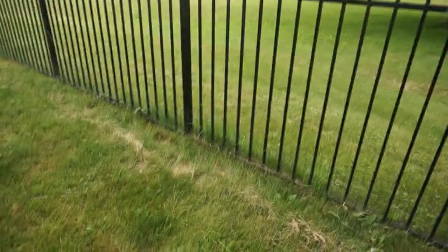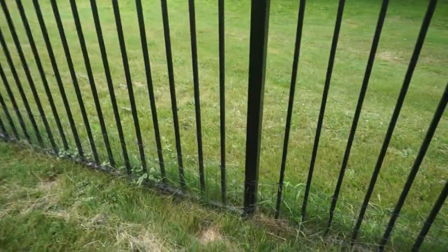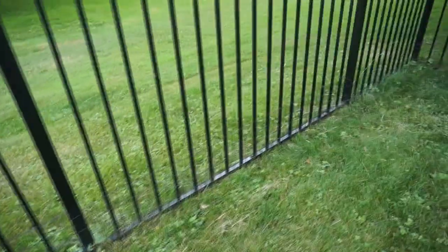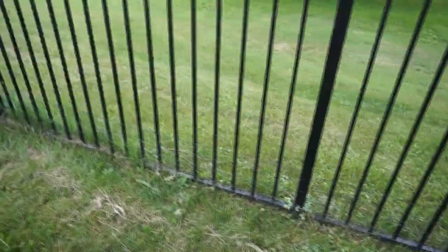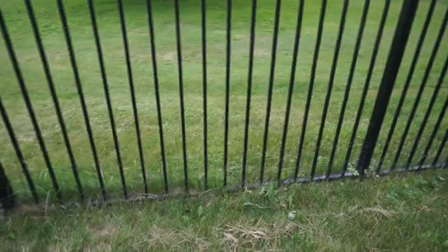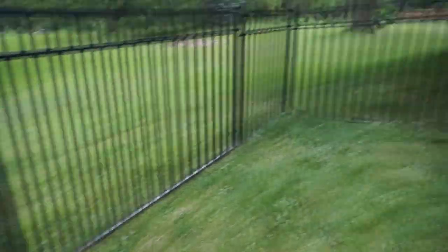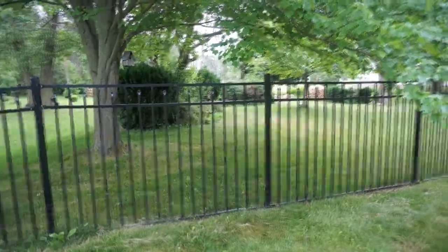One final note — you'll notice all the tall grass here. The instructions for this fence said to take a 2x4 and lay it flat, and that's how you got the spacing up off the ground. That's apparently nowhere near enough. If I had to redo this fence, I would definitely use a 4x4 to get up high enough so I could run the weed whip string right underneath. That's a tip for anyone considering this in the future.